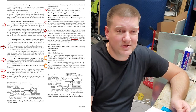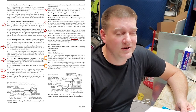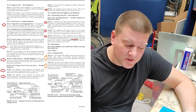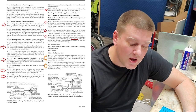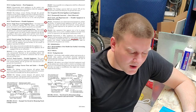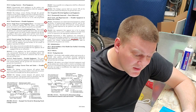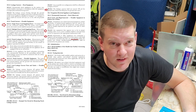This is the big one — section 10.5.2.1.1: the facility shall establish policies and protocols to identify what patient-care-related electrical equipment requires periodic inspection, where applicable the type of test, and intervals of testing. The facility gets to determine what type of tests and how often each device is tested.